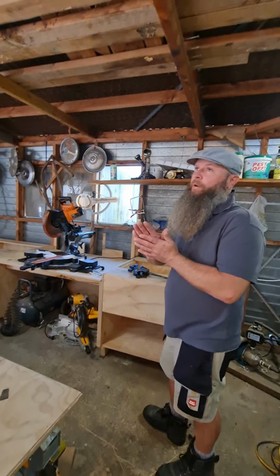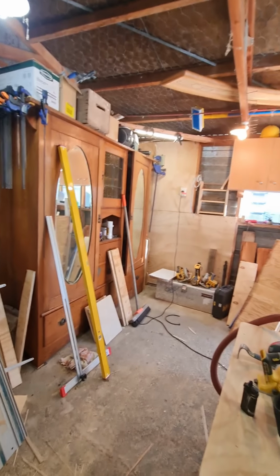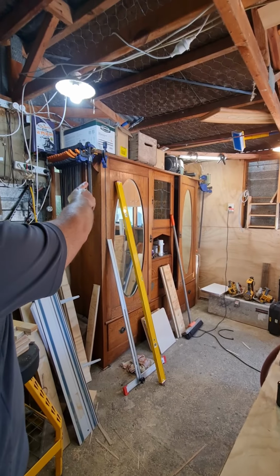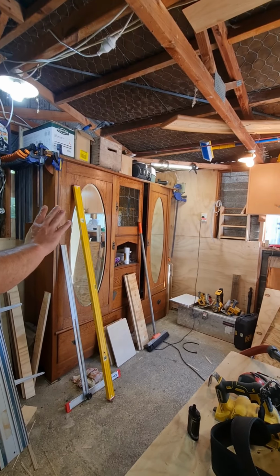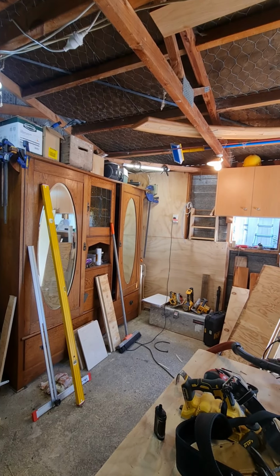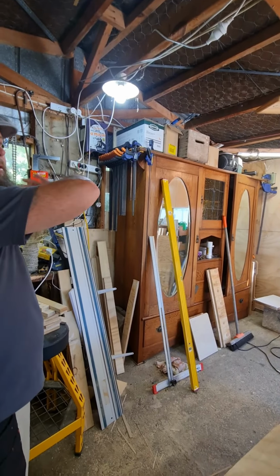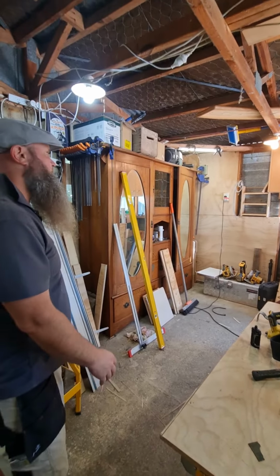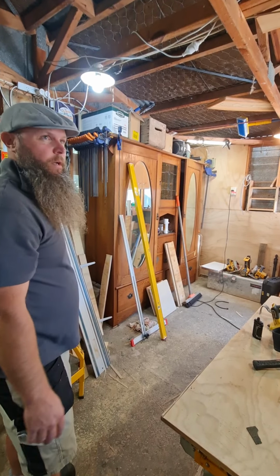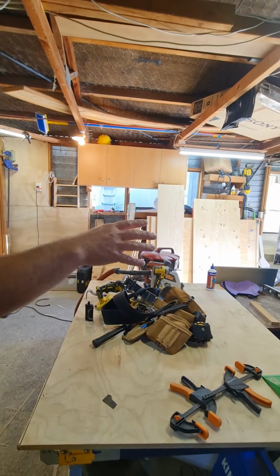And one of the key things that I'm doing in here is getting it ready for food storage as well, like preserves and the freezers and stuff like that. So you can see on this wall and behind the oak cabinet, which is obviously blocking the view, we're lining the walls with plywood. And when money allows, and we've got money and time, I'm going to rip off the external cladding, insulate, paper, new cladding. Maybe reuse the old cladding, we'll see how it goes. But getting the insulation and the paper in there is key. Paper's easier from outside, hence ripping off the external cladding.